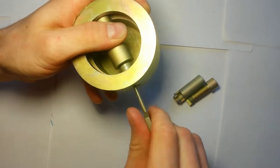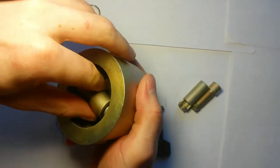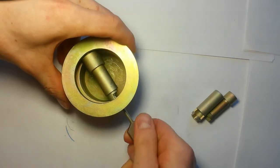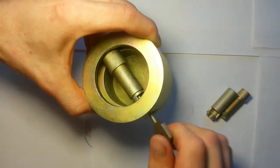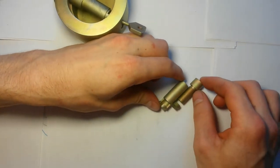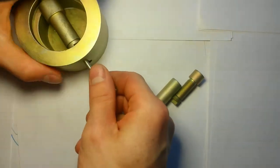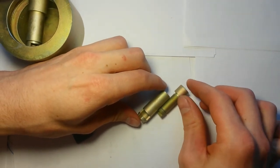The lock body has a free rotation on its axis. So after we unscrew the screw until it stops, you need to turn the lock body to the other side. Get the key into the groove. There it's easy to find the response part on the small screw, which we turn until contact with the large screw. When the planes touch inside the thread, the movement of one screw relative to the other becomes impossible. This is the basis for the secrecy of this lock. In order to turn the screw with the eccentric, you must first return the small screw that serves as a plug.